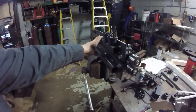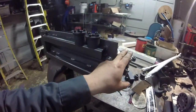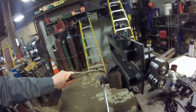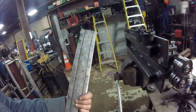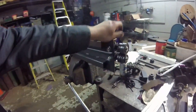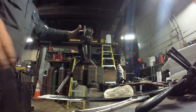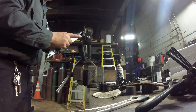The part's all welded up. Gave it a shot of paint - just that nice hammer finish stuff from Rust-Oleum. I ran a couple sample pieces through and found that the rollers were pretty sharp, so it was actually leaving a lot of bad burrs. But I purchased it so I could do offsets like this - it actually does pretty nice, not bad at all, very fast. I did want to show that this thing is rock solid. Before, I was actually able to bend this thing apart with two fingers, but now she's nice and solid. I just rolled through 18 gauge stainless steel, no problem whatsoever.